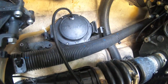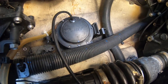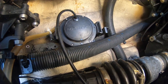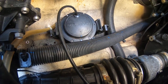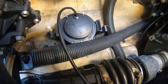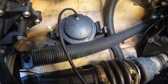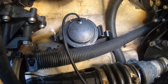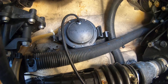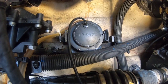You'll note that there's an arrow on the fish finder, and the instructions in the manual from Sea-Doo say that arrow needs to point toward the centerline of the hull of your boat. I suspect that's because the beam angle of this transducer doesn't shoot just a cone — I believe this is a GT15M transducer that comes with the Fish Pro, at least the 2019 Fish Pro, and it shoots an elliptical angle which is more wide than it is narrow. That's why you want to place the arrow toward the centerline of the hull.